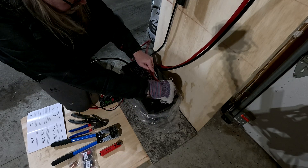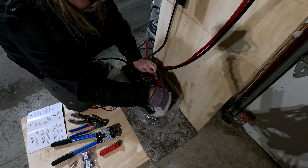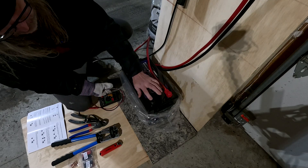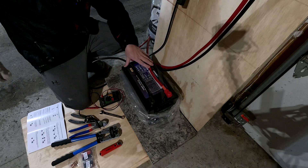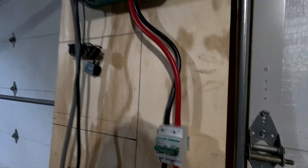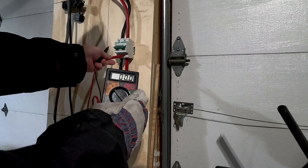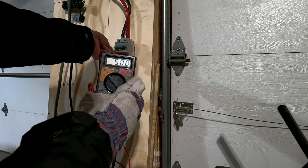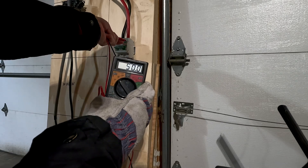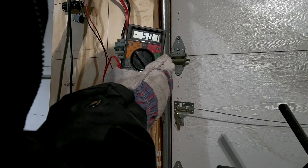This will be the positive. At this point we've got power going up to that breaker up above. I want to make sure your connections are nice and tight so you don't get heat built up on them — something else I've learned from reading about it. My breaker is currently off; I'm going to go ahead and turn that on. That's going to send battery power to the unit. We can check these real quick with a multimeter. I've got 50 volts at the bottom, 50 volts at the top, and I should have 50 volts up here on the inverter. There's the 50 volts at the inverter.